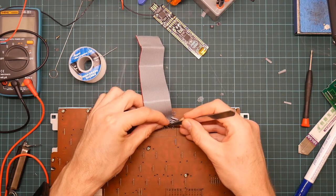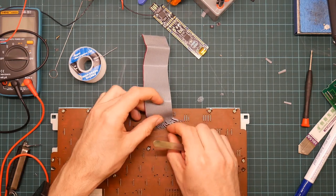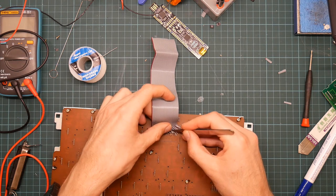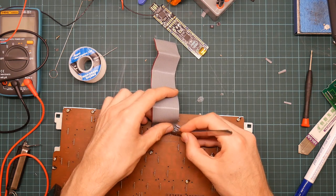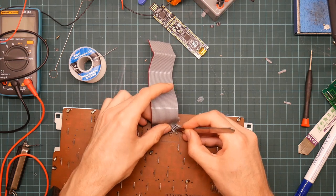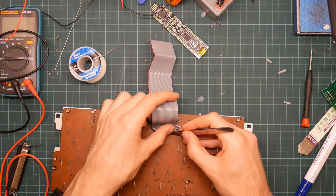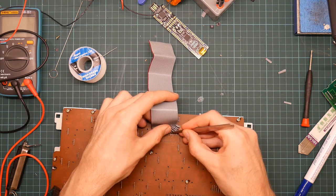It's an all-in-one environment where you can draw the circuit that goes onto the soft logic FPGA part of the device, and then it generates all the C code for the code part of the device. And no tedious setup required. You just design your circuit, write a few lines of C code that stitch your components together, and it works.